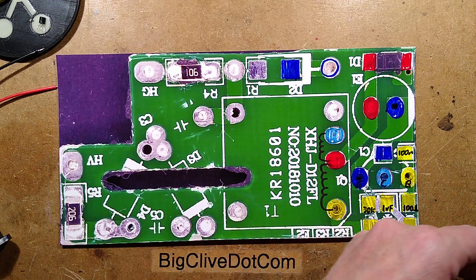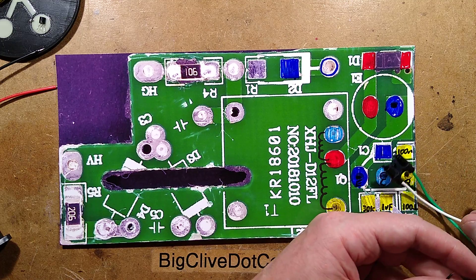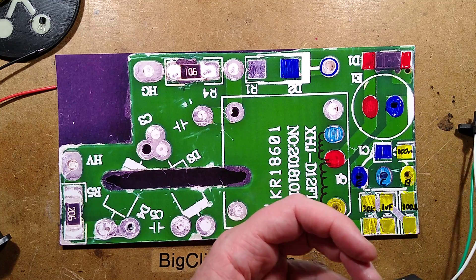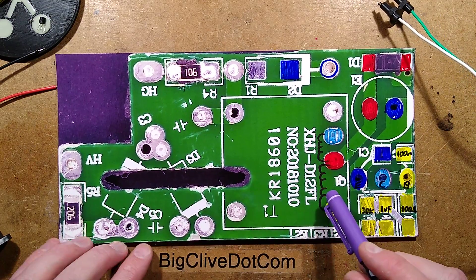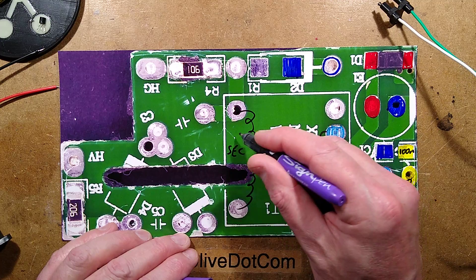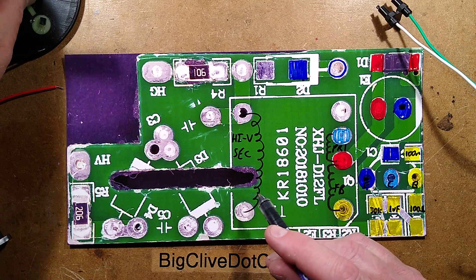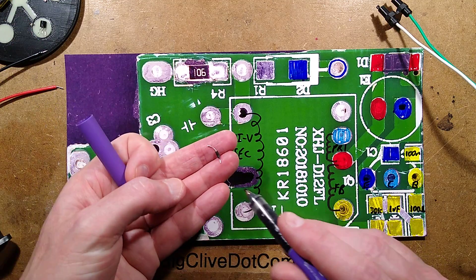It's very low current. Let me just hook this up to a bench supply. The current is 14 milliamps. This thing is now producing ozone at the tip — that's what it does. 14 milliamps at 12 volts is ridiculously low, which makes it viable to use on its own tiny little solar panel in remote locations for keeping places fresh. The transformer couples across to the high voltage winding — I'll call that 'sec high V.' This is the primary and this is the feedback.